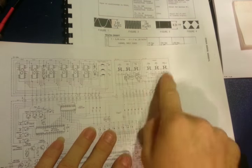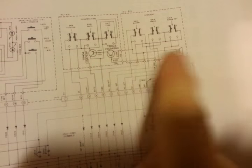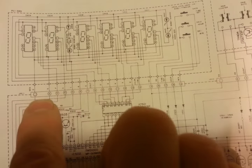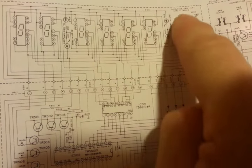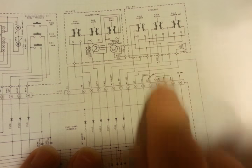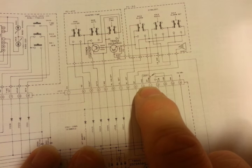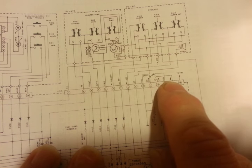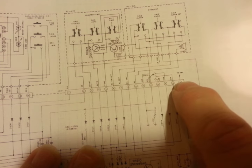at the service manual, there's the schematic, and here you can see, here's the switchboard. So here's those two switchboards, and this is that socket. So you have one socket here. All of the pins off of that one go up to this display board that has the three push buttons on it. And then your other socket goes to these two switchboards here. And then you add a three-position switch, because this would be your common. And then you have your lower, upper sideband, and then AM positions. And then that black wire that you saw me applying 8 volts to, that's the last pin. That's the one, the 8-volt transmit switching circuit.